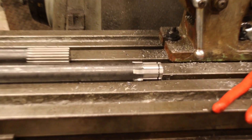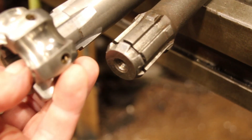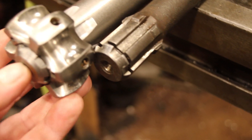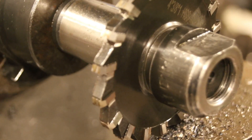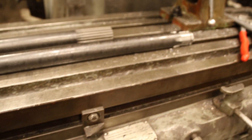Okay guys, I didn't get a lot of footage on the milling but I think you got the idea how the six splines are going in. There are the axles, there is the original six-spline, there's another one. I think you can see the fit — it's absolutely perfect. And there is the tool that I used, which is actually ready to go out to be sharpened again. There are the axles finished.